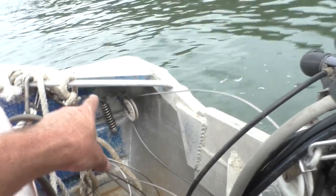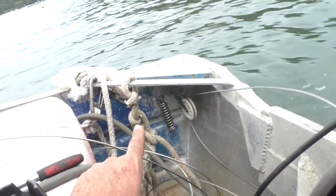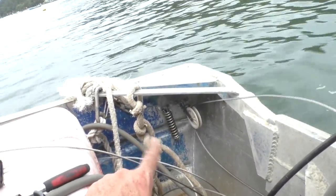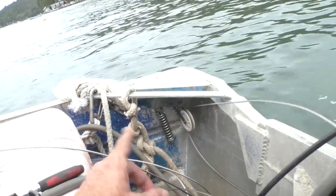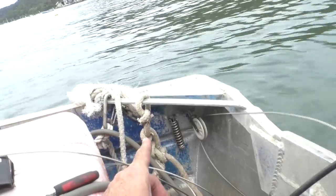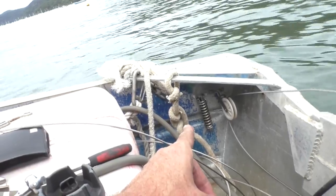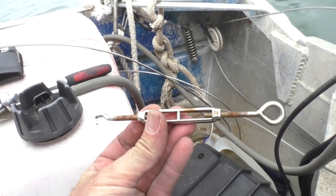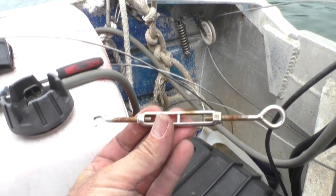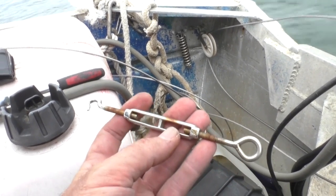The reason we go from the pulley to a pulley on the outboard and back to the transom is because it gives us a bit of mechanical advantage — a bit of a double block pulley to make it a little bit easier to steer the outboard. The spring there obviously keeps a bit of tension on the line the whole time, so that's why they're installed. We're also going to use some turnbuckles to help tension it against the spring. To start with I've got these turnbuckles wound all the way out so that we've got plenty of scope for shortening the line.